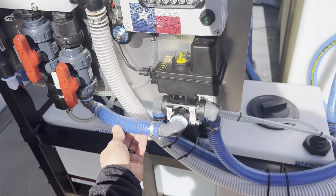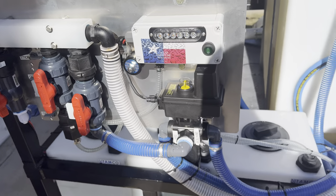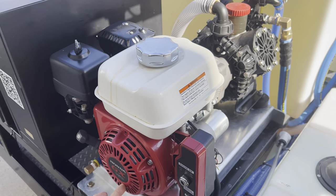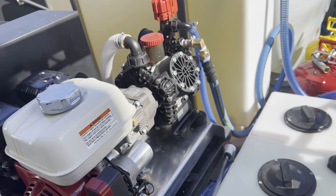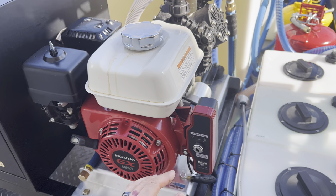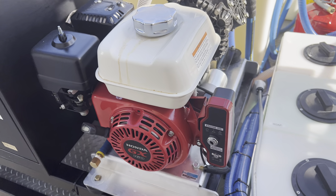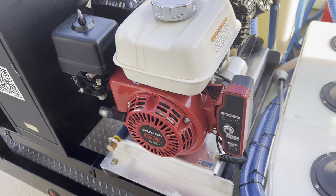All my hoses are one inch besides the line going to the AR pump, which is one and a quarter inch. The AR-45 pump is on a Honda GX160 motor — 11 gallons a minute. I've converted this motor to electric start; they sell a $60–80 kit on Amazon and it takes maybe an hour. You just take off a couple bolts, insert their wheel, close it up, run the wires, and that's it.